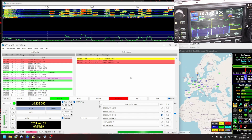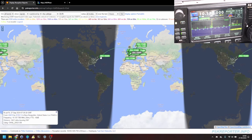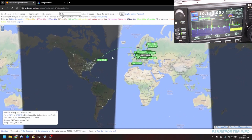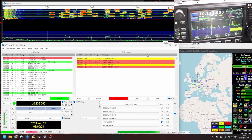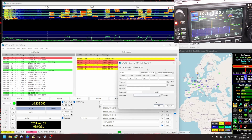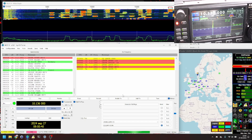Got several replies back — a German and a Polish station both quite strong. The German station is hearing me at minus 14 dB and the Polish one at minus 3 dB. Checking the map — I even got heard over in the States at minus 16 dB, and that's with one single packet. So that's not too bad. With two packets I would expect more people hearing me. That was the first QSO logged on this antenna — perfectly done, plus 11 sent, minus 14 received, with 5 watts output.